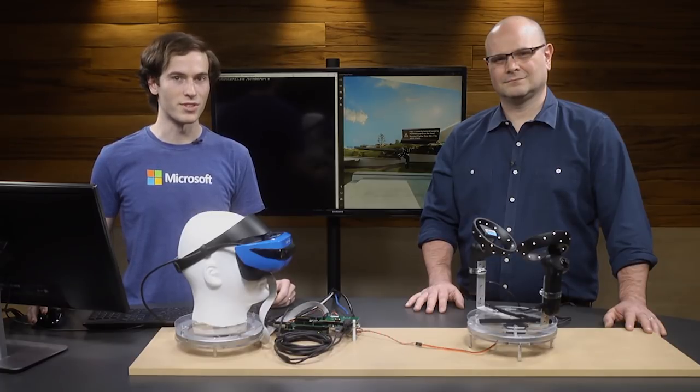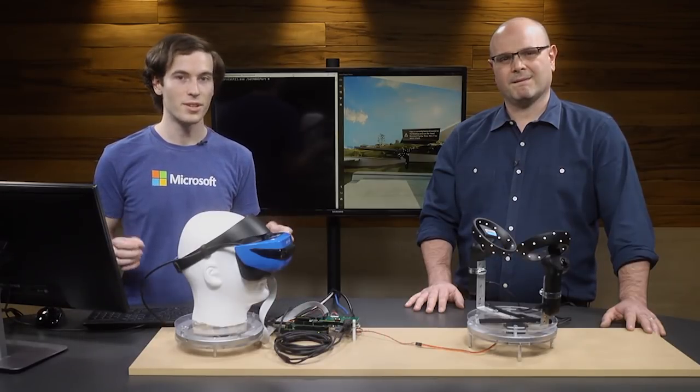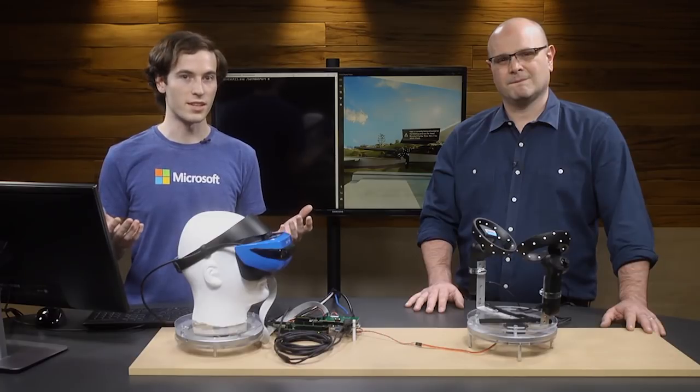Let's take a look at a diagram of the setup. We have a Windows Mixed Reality compatible PC as the base of the test setup. Connected to the PC via USB is the HMD Exerciser. The HMD is connected to the PC through the HMD Exerciser, allowing USB and HDMI to be either connected or disconnected via software. The HMD board is mounted inside the HMD and connected to port 1 on the HMD Exerciser. Since we're using motion in this setup, the HMD and controllers are mounted on turntables with servo control. Those servos are attached to the two servo ports on the connection Exerciser. The controllers are paired to the PC using Bluetooth and powered externally. Each part of this test setup is independent of the others, so feel free to tailor your specific setup to your needs.